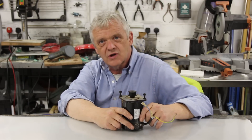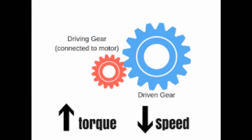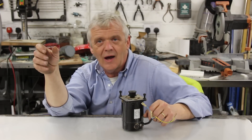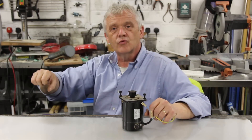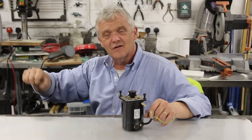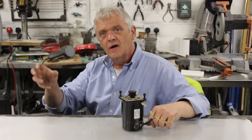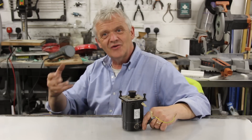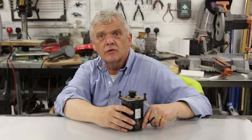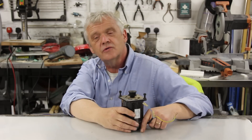If I want to turn that at 4000 RPM, I clearly need some gearing system to go with it. With gearing, you trade off torque against speed — the higher the speed, the more torque we're going to have to put in. I can turn physically with my hand around about 80 RPM. If I put a handle on there geared so I get 4000 RPM at the motor but 80 RPM where I'm handling it, I'd need a turning force equivalent to 150 watts. I don't have that in my arms — I've got about 60 watts — so I'd have to put it on a pedal, or have a strong enough wind so that the torque requirement at the gear chain matches, in which case we would get 150 watts out.